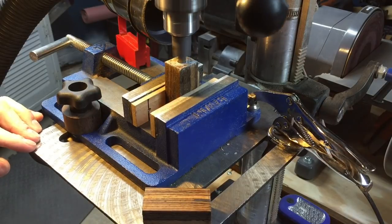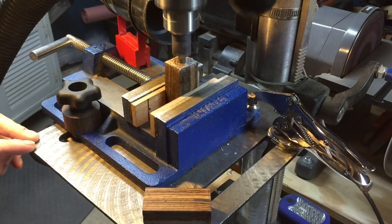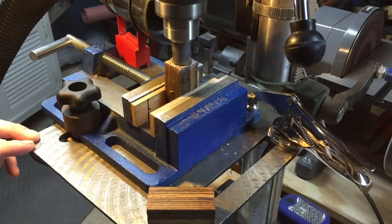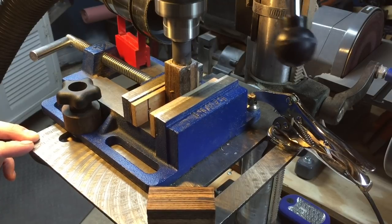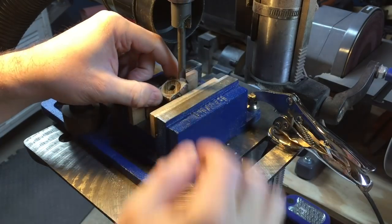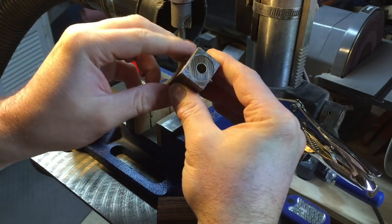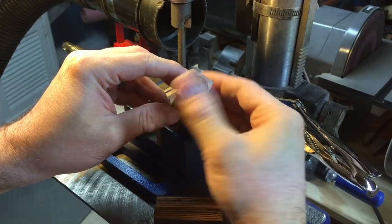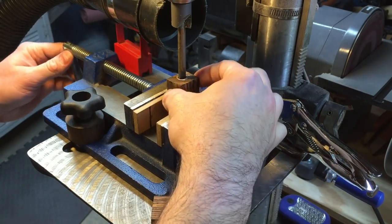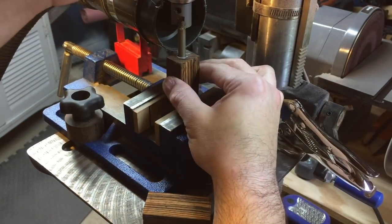This step is perhaps one of the most important — squaring the end of the blank. That way you don't have any gaps and your wood is flush on all sides to the pen kit hardware. I'm using a carbide barrel trimmer. I like this method because it cleans out the tubes and does a really good job at making them flush. When squaring up your pen blanks, make sure you stop right at the brass barrel, just enough where it just starts to get a little shiny, or else you can have all sorts of problems later.